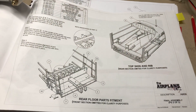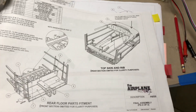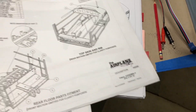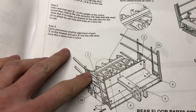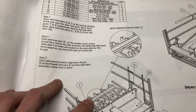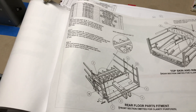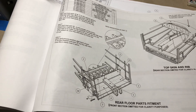So let's get into the changes. The first step shows up on page E20 of the TSI installation manual, or if you're following the Sling 4 manual it's the same information but it's on page E14. The first step is installation of the strengthening channel shown here in the detail diagram — it's CF channel 39, called the back seat strengthening channel. That's what the bench would rest up against, and that's where we're going to move forward with the modification.